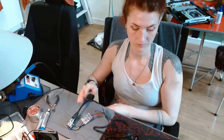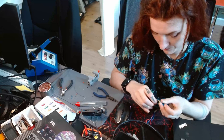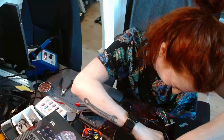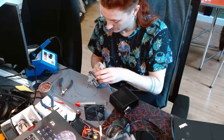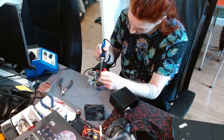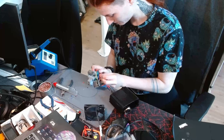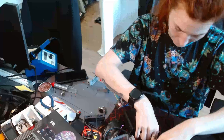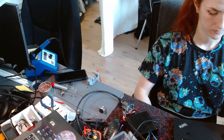Now it was time to add the Ethernet module, as I didn't just want to rely on Wi-Fi because it can lead to instability of the signal. Here too I bumped into code issues, which I figured out after measuring the physical connections with my multimeter again. The device was continuously going into a boot loop when I was using certain libraries. After some digging, I found out that my Wi-Fi library wasn't compatible with my Ethernet library — it caused a crash and a boot loop. I swapped ESP Async Web Server for a Wi-Fi server, and soon I actually had some signal.